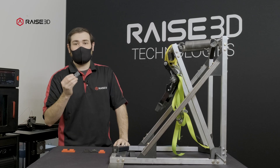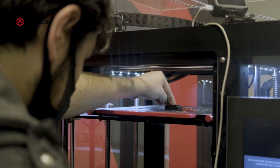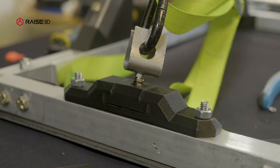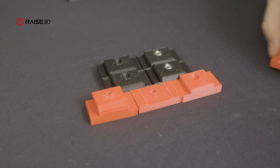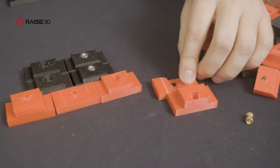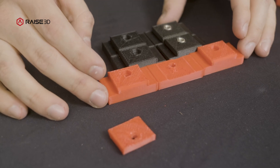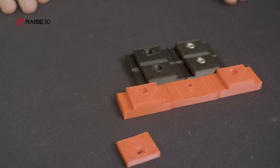The next ones use pause-at-height points in the g-code: the part prints up to a certain height, pauses, we drop a nut in, then continue printing to seal the nut inside the block. Different from the reverse inserts or standard press inserts, these tended to pop off the upper layers above the nut — partly due to the pause at height. On average the PLA ones took about 62 pounds of force before breaking, and the carbon fiber nylon ones got to about 58 pounds — pretty comparable ranges.